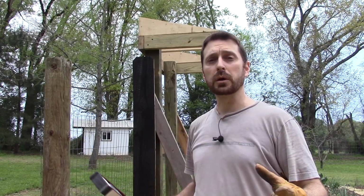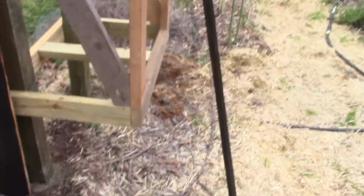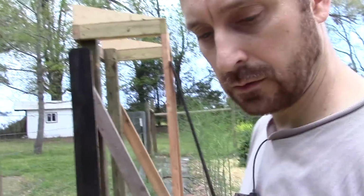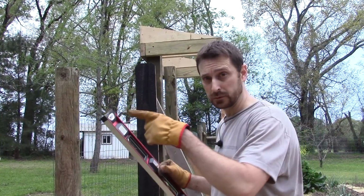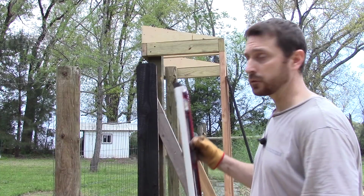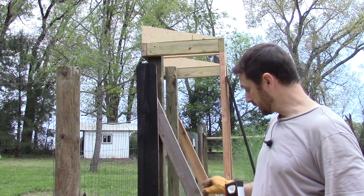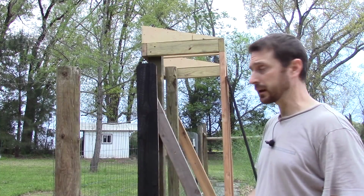So we've got it anchored where we want it in the garden. Now what we did was we just dug 2 holes with a post hole digger, 18 inches deep, and we concreted those in on the bottom. What we're doing now is, like we finished our door inside. We're going to nail our siding here on the outside. Of course, we want to check for level in every direction. Once you're set and level and things are good and set up, you can start putting your siding on.